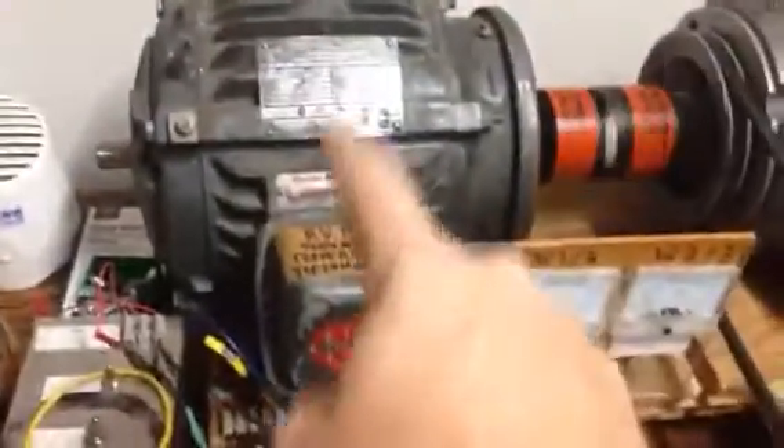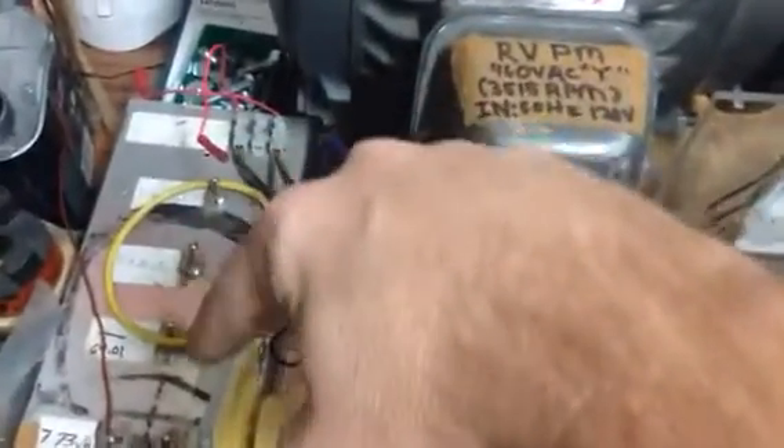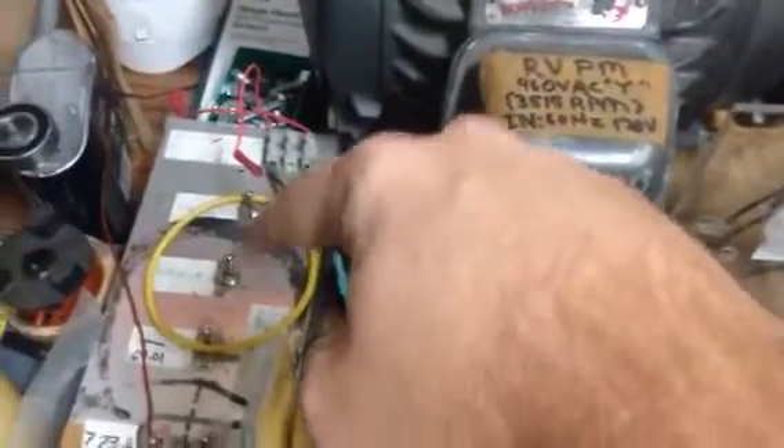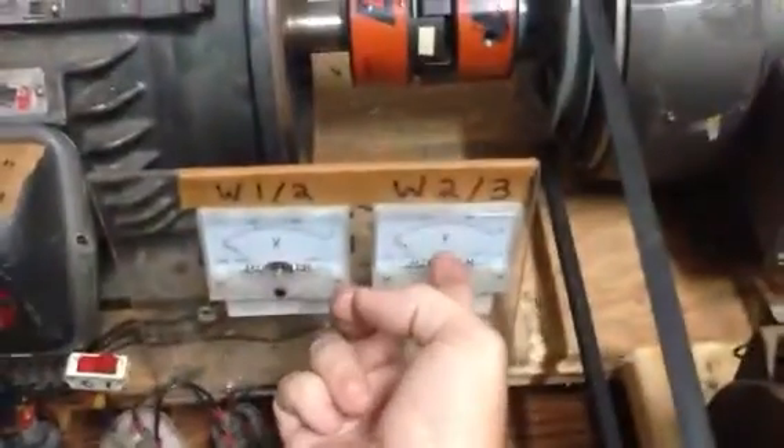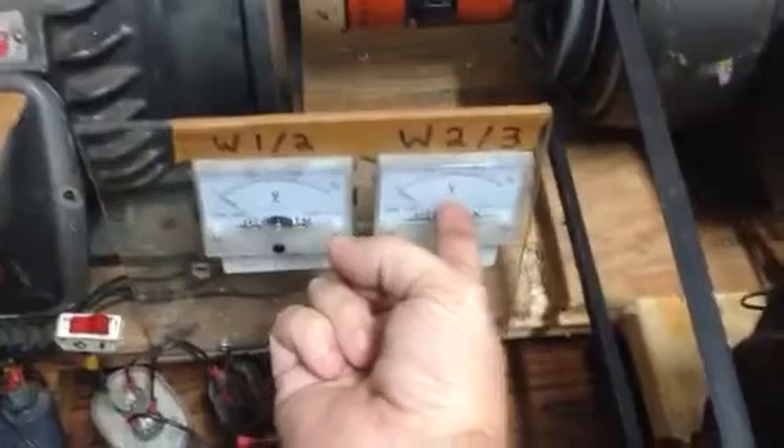Alright, let's explain just what happened there. The drive motor here uses an exciting capacitor between phases 2 and 3. This is the control of the exciting capacity. These three switches are AC start caps — about 100-and-some-odd microfarads times 2, and then 69 for the third one. These caps down here are the AC run caps that can be switched in and out, along with these caps which are also AC run caps, currently switched out. That's what controls the exciting voltage on wires 2 and 3.